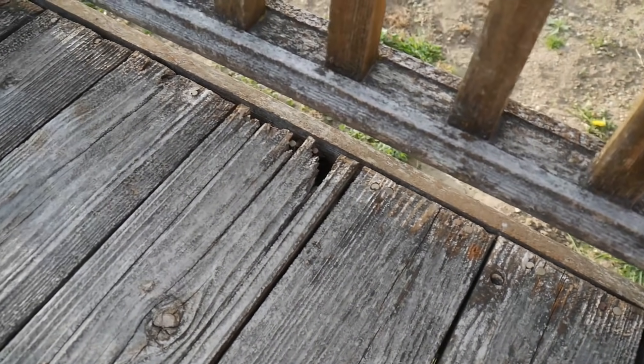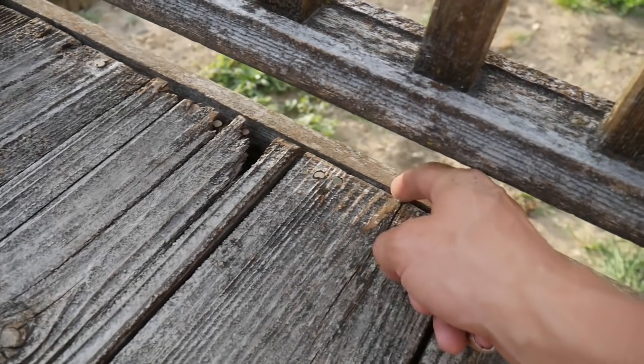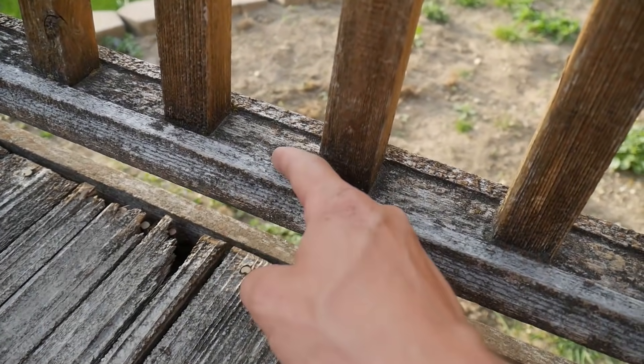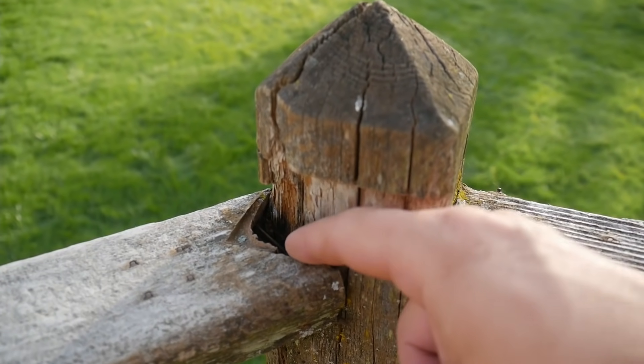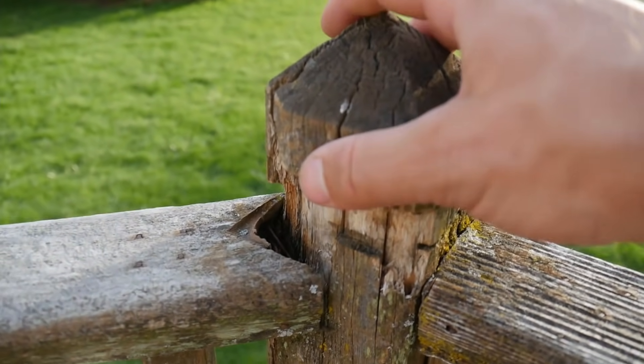Here's another area where you can really see how having the fascia up against the decking, where you can't get any sealer in, is a terrible idea. And this — another terrible idea — just putting an area where pressure treatment can puddle up water. That's a great idea. Really? Galvanized nails and no drainage. Let's not put any places for water to puddle up on our pressure treatment.